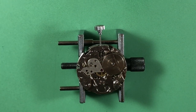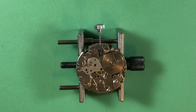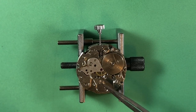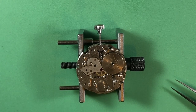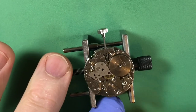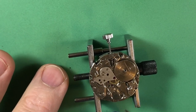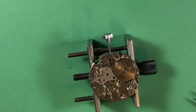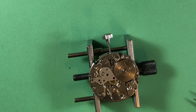We are in the process of coming back together. I didn't find any obvious issues. The center wheel jewel in the main plate was a little shifted out of position, but that does happen and I tightened that up. I have the front side and the calendar side together, so really we're just looking at the fun part now.